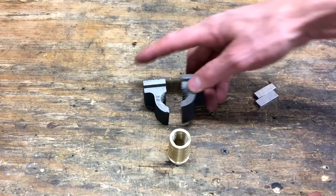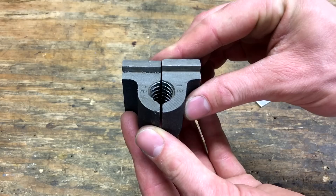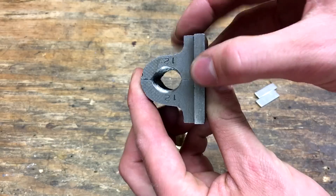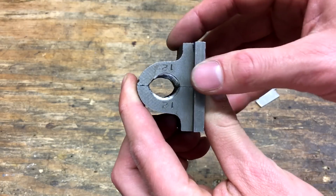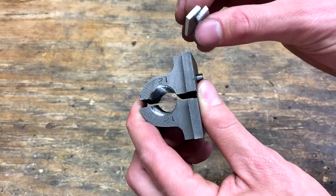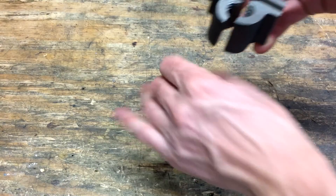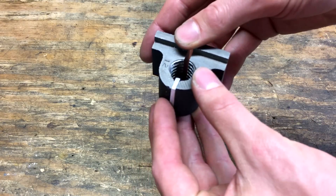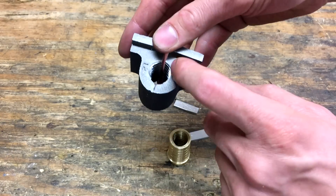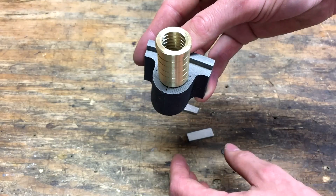The next step will be to bring these and set them up at the mill. They'll set up vertically like this, and when they're engaged on the lathe they're not fully together - they're about an eighth of an inch apart. I've got little spacers out of eighth inch aluminum that, when we clamp them in the mill, we'll put in the middle and space it up so our hole is round like it should be. Then we'll bore this out and then we'll be set to epoxy this inside of there.